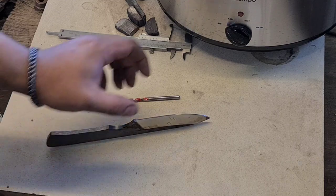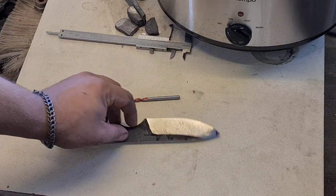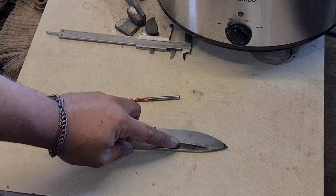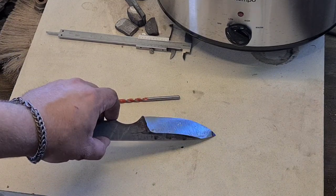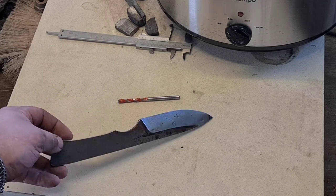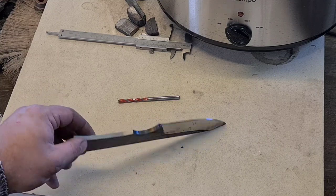And so what we're going to do now is I'm going to heat treat it, and then I'll show you how I get it down to zero while maintaining this ridge there. Now, the ridge is harder to keep in a convex grind. It's kind of hard to keep in a flat grind. It's much easier in a hollow grind, but obviously I don't like hollow grinds, so we're doing flat. All right, so I'll heat treat it, and then we'll come back to the grinder.